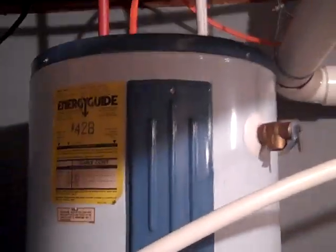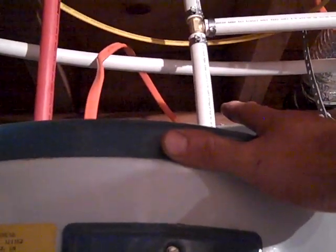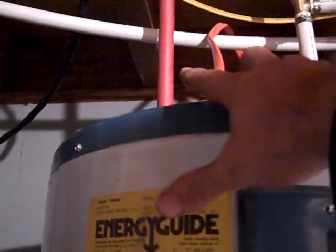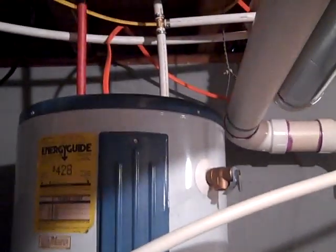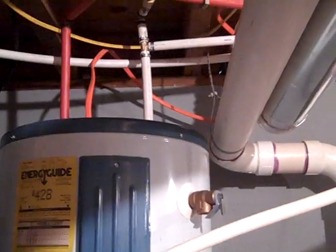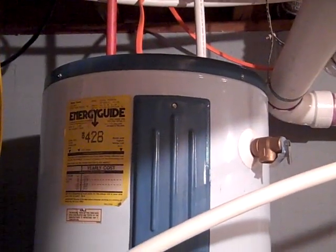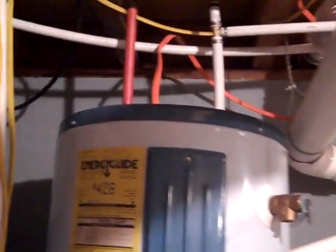This might not make sense at first, but with a typical water heater, we're bringing water from the tempering tank into the cold side of the water heater. The hot coming out is actually going to go to an instant propane heater — yes, this is a lot of redundancy. The first way to heat the water will just be from the tank being up in the attic loft, which gets very warm in summer, preheating the water before it hits the electric water heater running off the wind turbine and solar, or a generator.